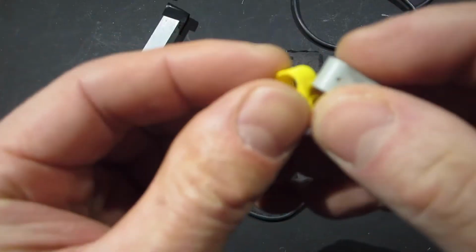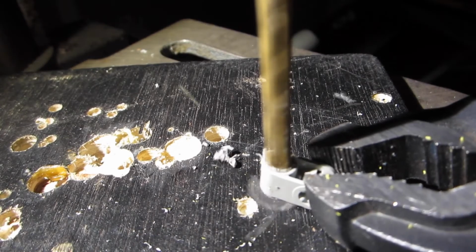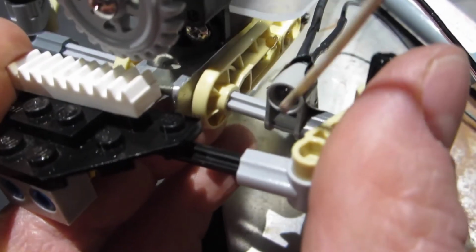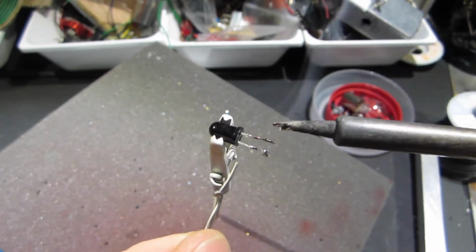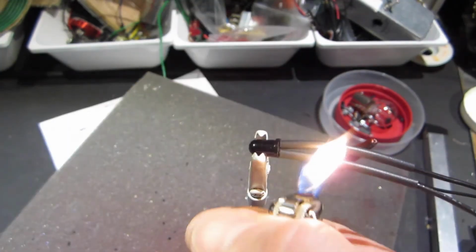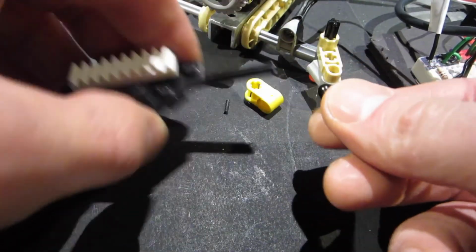Well, believe it or not, we're gonna put these on the drill press and widen the OD of that hole ever so slightly. So that right there, that's the infrared emitter. I gotta remember the long side of this thing is actually the negative. Just counterintuitive. It's usually on these little LED packages, long leg is positive. This is somewhat satisfying since we got these things drilled out special, and now we can pop this guy on there, yep, and do like that.